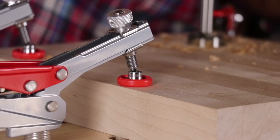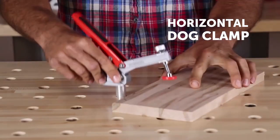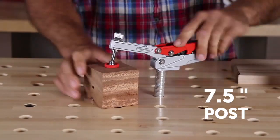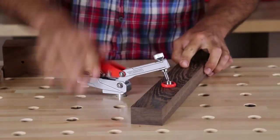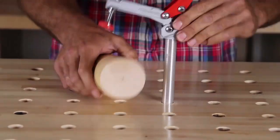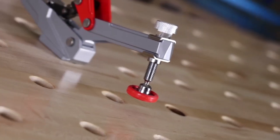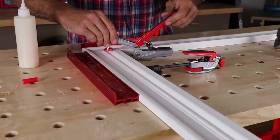Vertical pressure is applied by Armor's Horizontal Dog. The auto adjust technology, in conjunction with the 7.5-inch post, allows the user to select the desired pressure and clamp materials of heights up to 5.5 inches above the table surface. And you can use the rubber fitting to reduce marking on any delicate pieces.